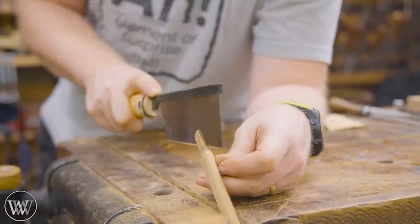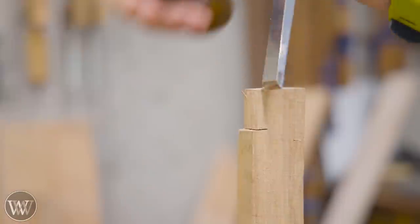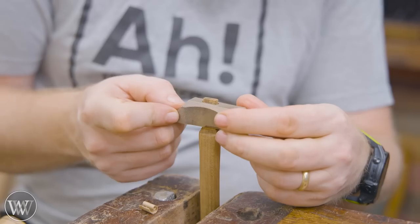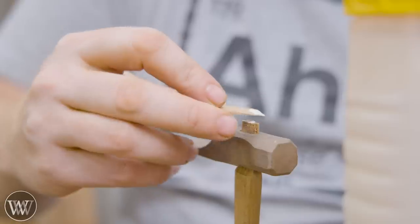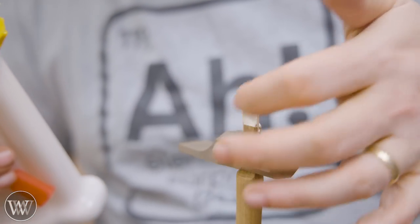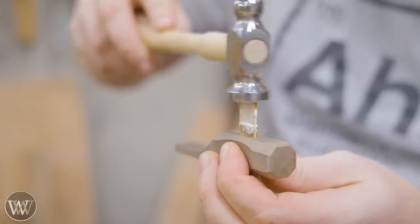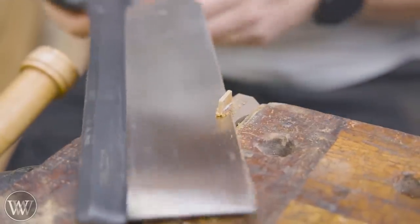I haven't made one with the Reed kit for myself, so let's do this. For the wedge, I'm going to grab a little piece here and just split it off — just getting something with a nice, clean grain. This is a piece of maple, and I can split it and shave it down with a chisel. It's a very simple little step to make and it's a lot of fun. Putting a dab of glue in there gets the wedge ready, and then we can start pounding this down in. The top of the head is angled so this will spread out and fill the gap — that way the handle is actually fatter at the top. The trick to this is you want to be very, very slow. Do not bash this in; just work it in little by little and you'll be able to get it down to the depth you want.